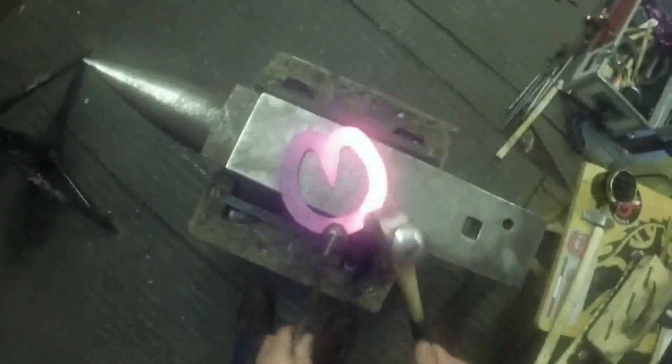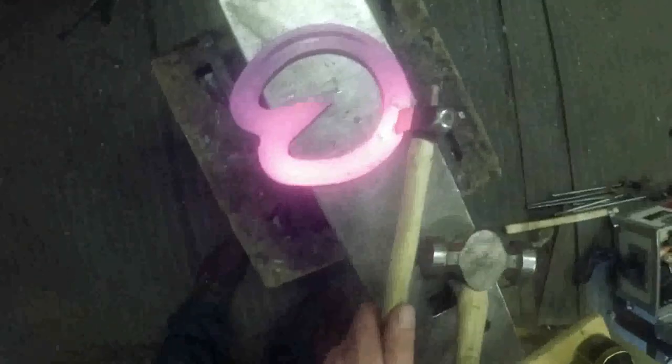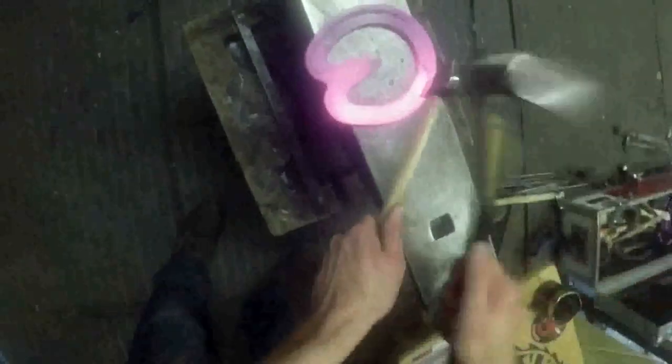So fuller an edge again, start from where you marked it, all the way around the shoe, and when you get up towards the frog plate, you've obviously got to go a little bit closer towards the point of the bick there. Give it a level, make sure that frog plate's lifted up rather than sticking down, so the shoe doesn't pivot round on it.